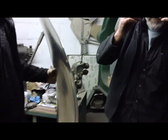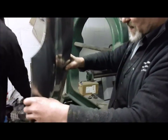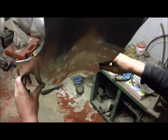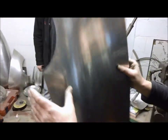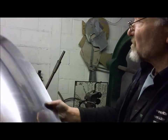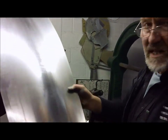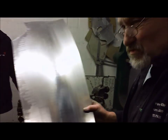Making sense? Yeah. So just bear that in mind — as you can see now, the panel is beginning to take on quite a nice form. With all the wheeling that we've done there, Bill, we haven't destroyed the panel because you're not wheeling with loads of pressure. It's all 99% there. You're keeping control of that all the time. Well, that looks as if I'm just raking it through — I'm not. Should we use the word scientifically? Methodically — that's the one.